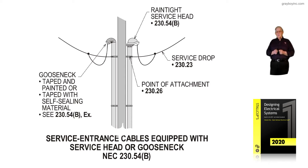What you see more today is the installation to the right of the illustration. Notice we have a rain-tight weatherhead, and the weatherhead has the conductors coming out through holes of the head, which we would then terminate to the service drop.